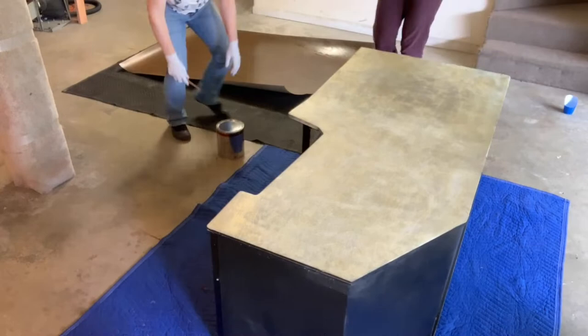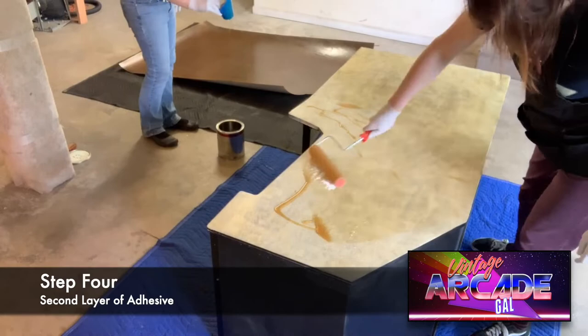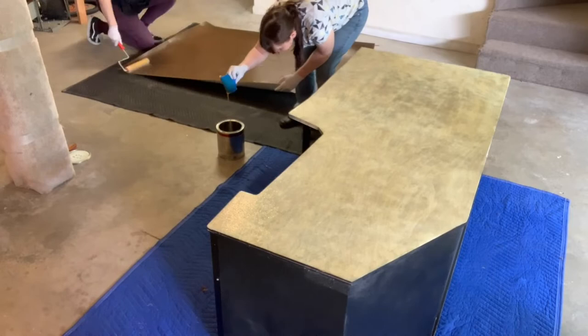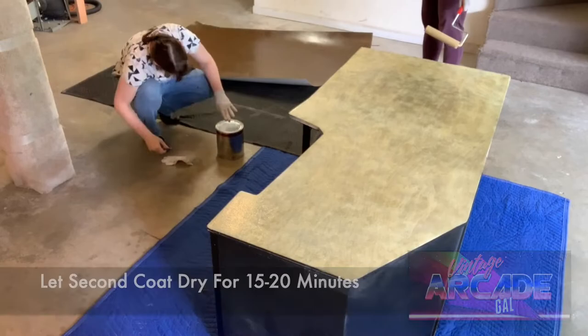Give that first coat about 15 minutes to dry — it just depends on your ventilation. You'll be able to tell it's ready when it starts getting tacky, then put on a second coat. You probably won't need quite as much for the second coat, but it depends on your work surface. The laminate side doesn't seem to need as much as the cabinet side — the wood of this cabinet was particularly thirsty. Make sure you get those edges nicely saturated without going overboard.